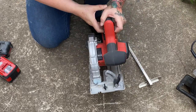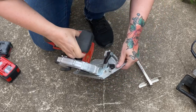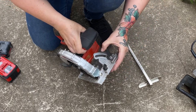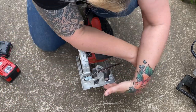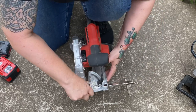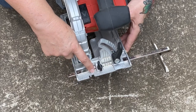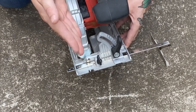If you want to do the 45-degree cuts, it's over here — just release that, and you can see it gives us any angle between 0 and 45 degrees for a beveled side cut. I'm going to keep that on 0. If you want to put an edge guide in, you can actually put it in either way. We just tighten that down wherever we need it, and we've got our little cut guides here as well — 0 degrees, and a wider one on this particular one for your 45. That allows you to figure it out if you're not doing a full 45-degree beveled side cut.